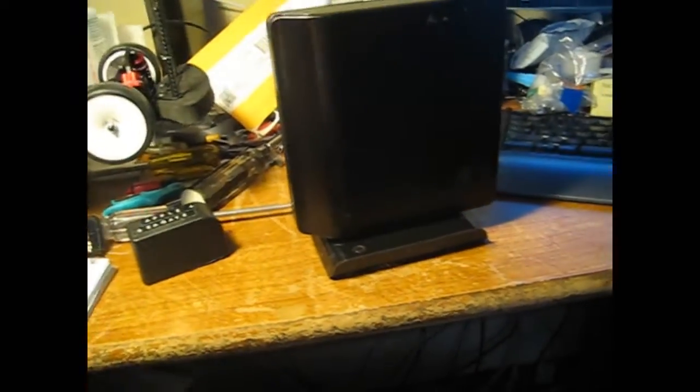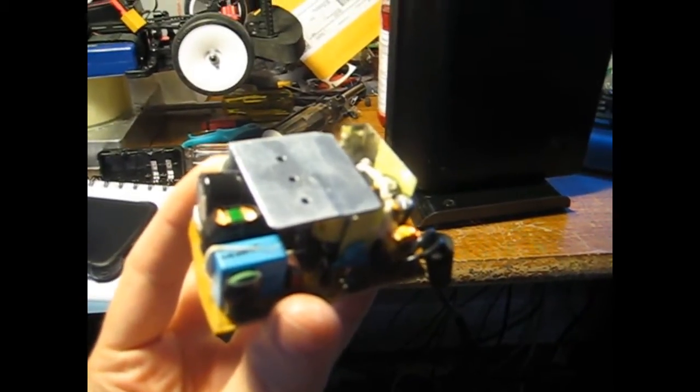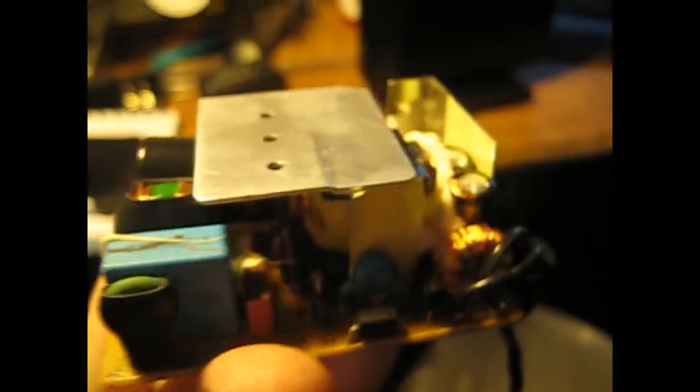You've got to get them open. These broken-looking bits are actually spring-loaded contacts that contact the board right here. The problem — want to guess? Capacitors. These two right here on this side — those are the only two that way — they are popped. They are no longer flat on the top. They have not started leaking all over the place, but they are no good. That would make sense since the power supply was still putting out 24 volts — it's kind of still doing its job — but it just can't handle the current draw being asked of it.